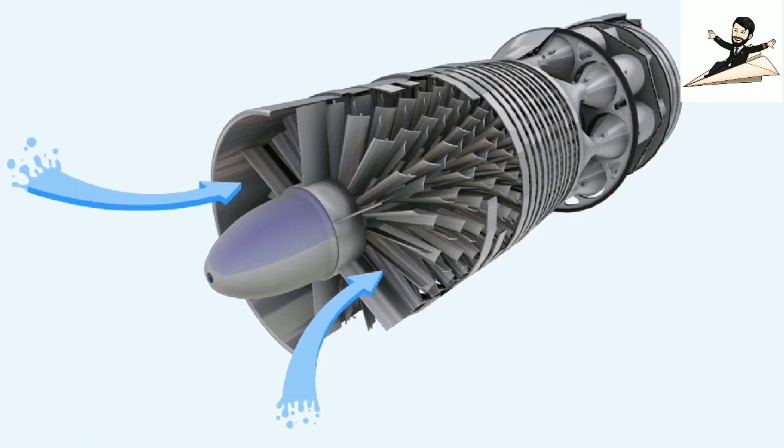The turbine can also benefit from a performance recovery wash. For some engines, frequent applications of the emulsion cleaner may justify an extension of their service life.